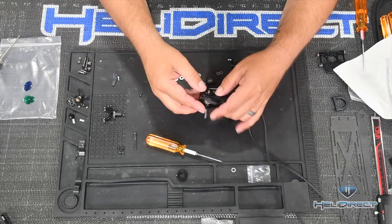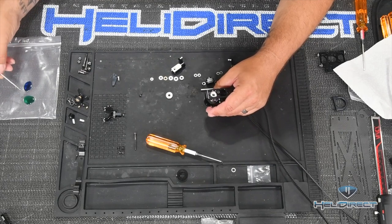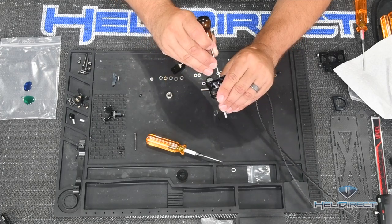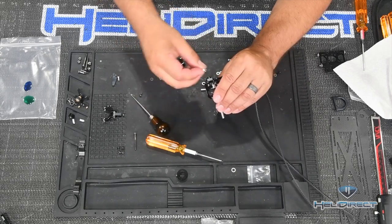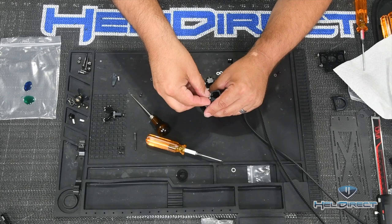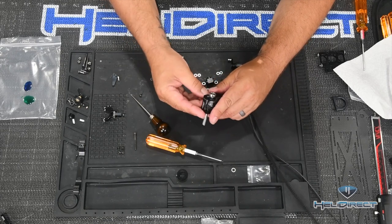And we're going to get a little bit of Loctite on, or I should say retaining compound or green Loctite, around the casing here. So I'm just spreading it around here, same method as before, and then we're just going to press fit this bearing into that hole, and really if we kind of slide this shaft up, it'll help square this in. Alright, so now we've got it.